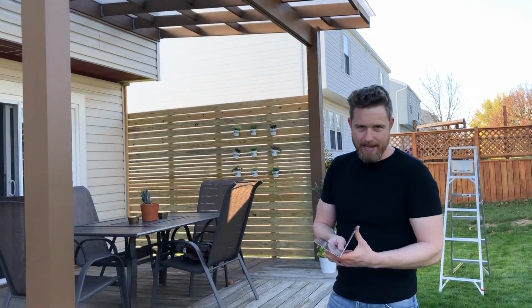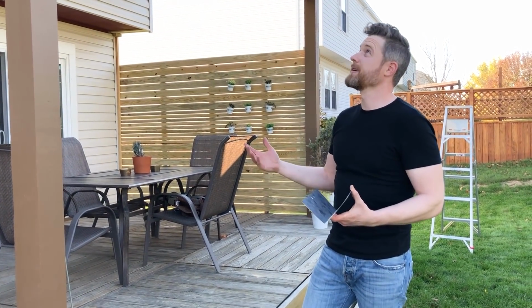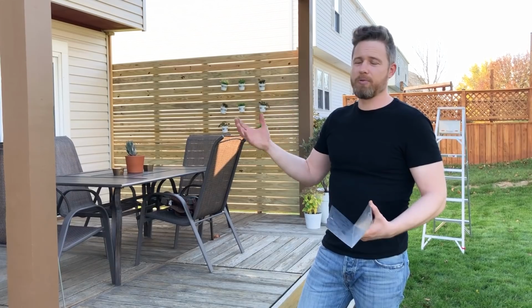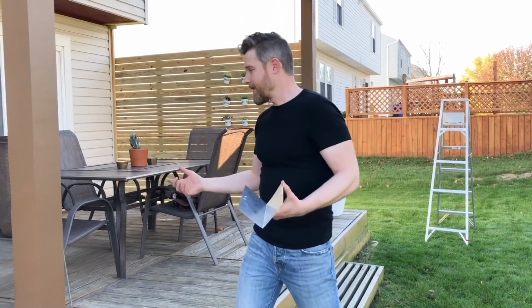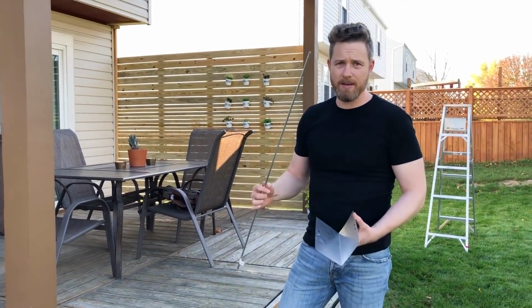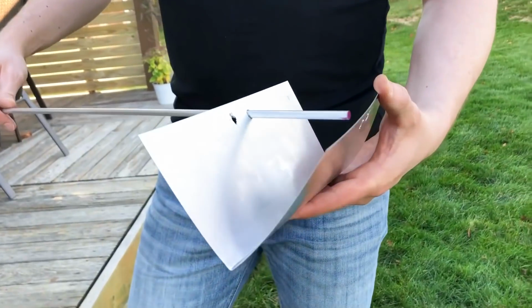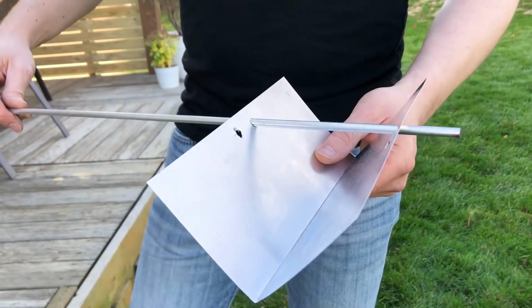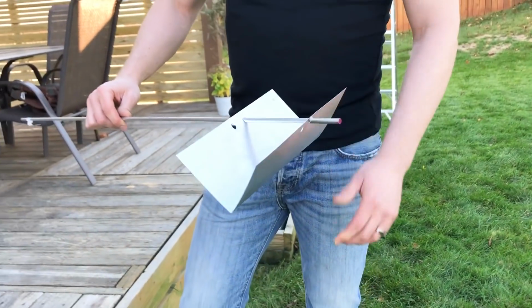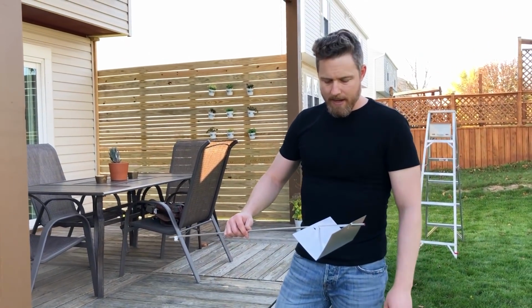And then I've got to attach it, and I've been thinking a lot about what I'm gonna do to try to attach it to the roof, because usually when you put a prefabricated gutter up there, it has clips that are specifically made for it. You just attach it, and I don't have that. So I'm going to try using this. This is an aluminum post. I pre-drilled some holes just to test it. And it turns out that when you thread this thing on here, it stabilizes itself. The metal from the flashing actually bites into the post, and it doesn't move.